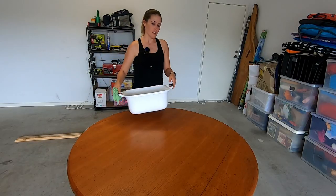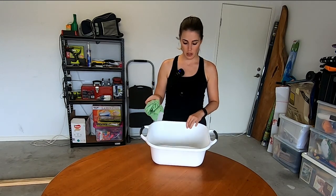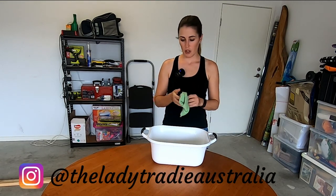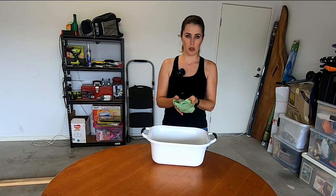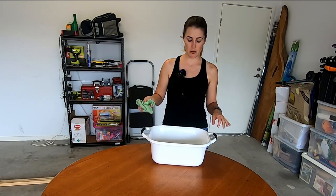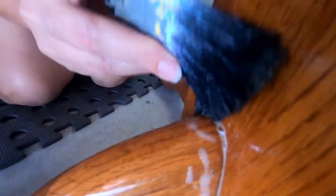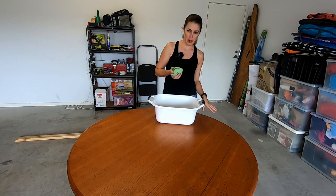The first thing I need to do is give it a really thorough clean. I'm using some laundry detergent or dishwashing detergent and a microfiber cloth to pick up all that old dirt and dust that has built up over the years. I've squeezed the cloth out thoroughly so it's just damp because I don't want my timber to get too wet. Sometimes it's helpful to have an old paintbrush ready to get into all of the joins and little nooks and crannies in the detailed base and legs.